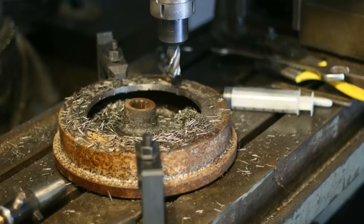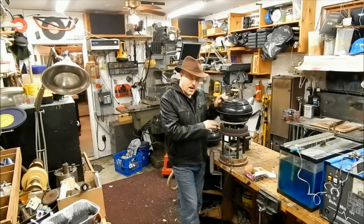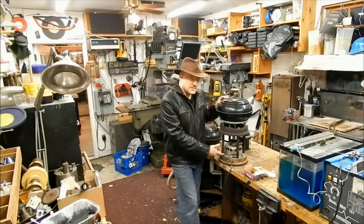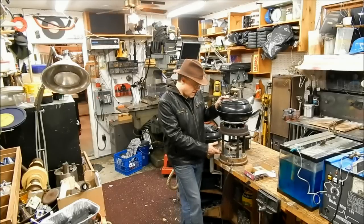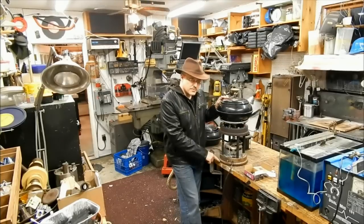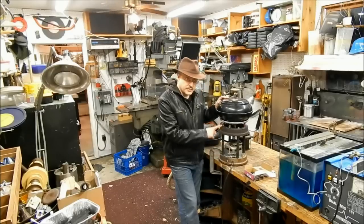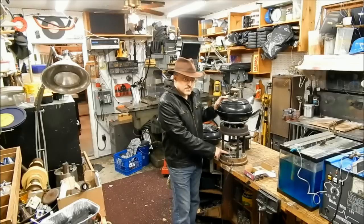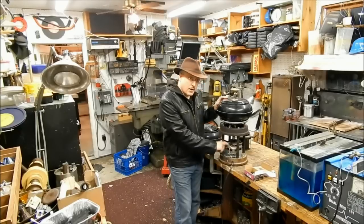And I machined those on the mill. I cut the centers out. And for the top one, I machined some pockets for the springs to sit in. The two drums are connected with these pieces of black iron pipe that I've just cut off, and there's a threaded rod that goes through the center, of 5/16 inch threaded rod, and that's bolted at the top and the bottom. I fabricated a sheet metal bracket to hold the motor in place.